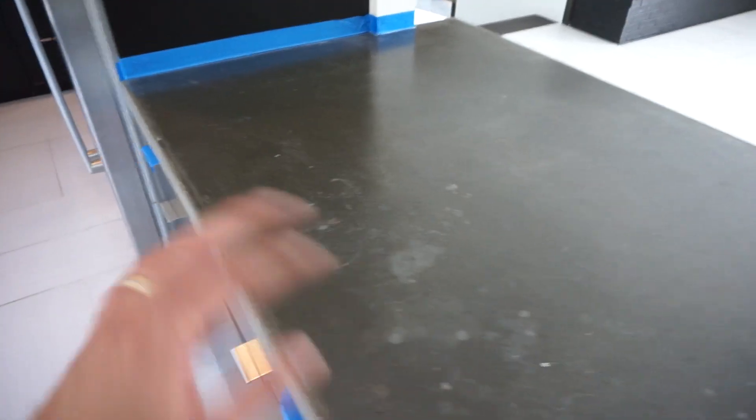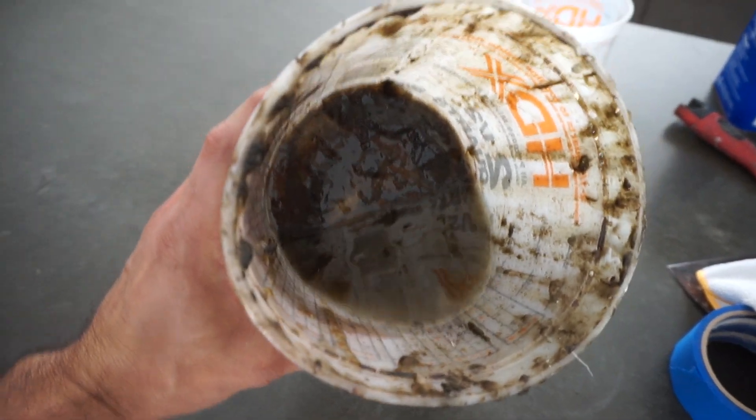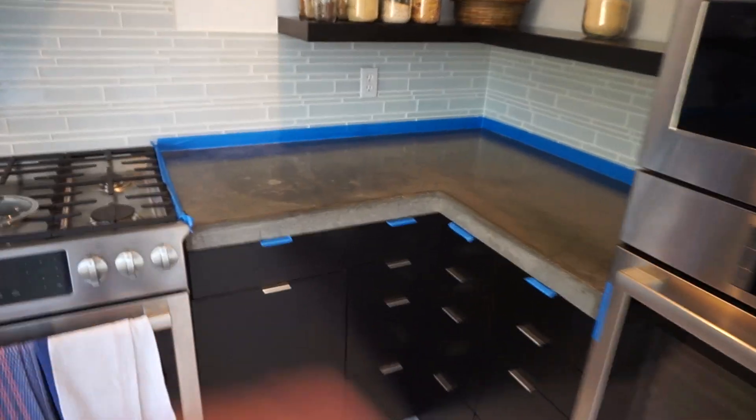What I'm doing is stripping off whatever residue is on here, whatever sealers, whatever's there. That way it allowed me to apply my new sealer — a sealer that's actually going to protect it and not collect all that gunk and residue in the future. Because when you go to maintain these tops, once it's properly sealed, you just sand it, give it a nice wipe, solvent wipe down, get the residue off, and then put the sealer of your choice. When you get stuff that's just gunking off, that's probably a wax finish — and what I'm doing is melting it and stripping it away, scraping off all that excess. Just like always, taping off and making sure everything gets protected.